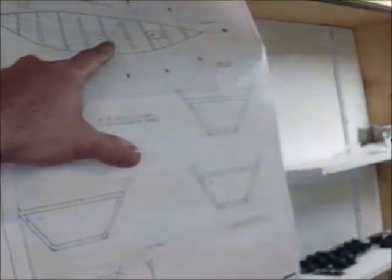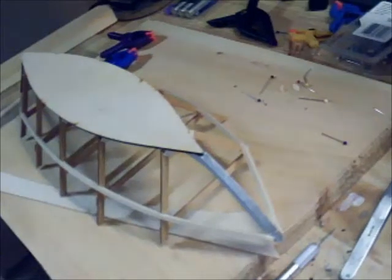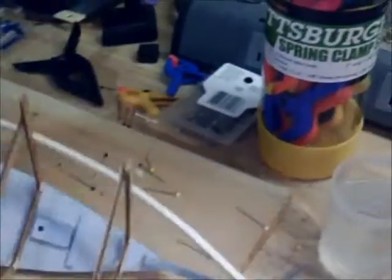So if you use that, put the glass on top, I didn't put the glass on top, I basically flipped the boat over, matched it up to make sure the frames were true around there, and then pinned through the top of the frames to hold it down while I was truing it up. If you soak the wood, this will go together lickety-split with a minimum amount of swearing. If you don't, you will want to make sure your kids aren't nearby, or anybody else that gets flustered by a high degree of swearing.